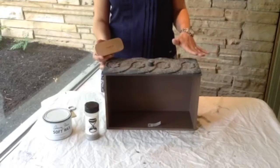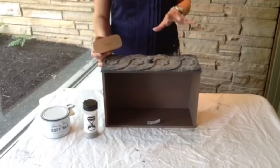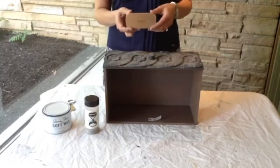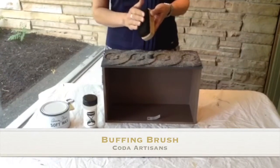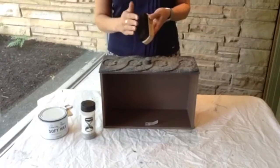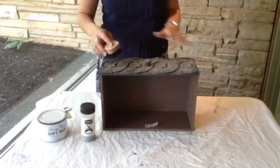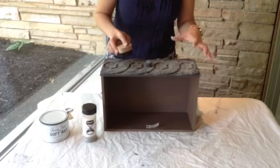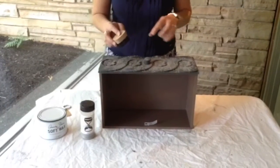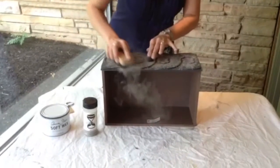We've let our wax dry a little bit with our aging dust on it and now we're going to buff it and polish it. We really like using one of these brushes — this is a buffing brush, also from Coda Artisans, and it has a really nice horse hair bristle specifically made for buffing the wax on furniture. This is going to give us a really nice patina. Because the aging dust is also a polishing compound — a very fine polishing compound — it gives it a really beautiful hand to it. So I'm going to go in and start buffing.